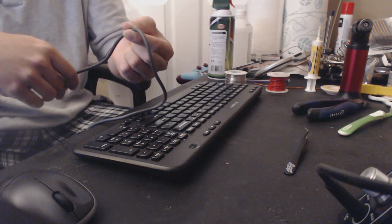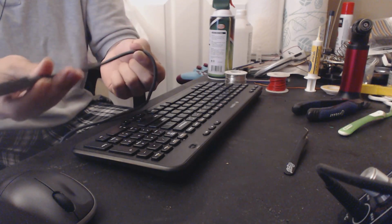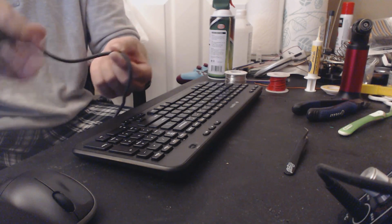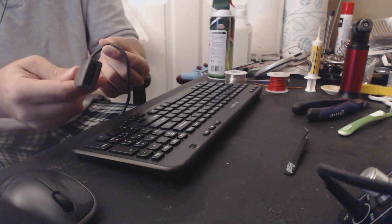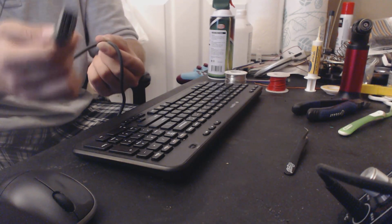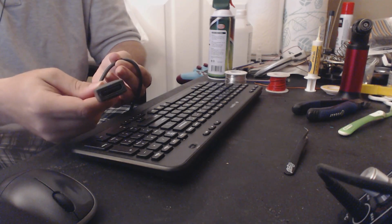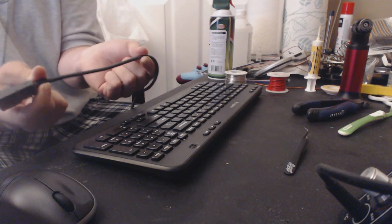The idea of this is that if you want the microcontroller closer to you, you cut on the female end. If you want the microcontroller closer to the console, you cut on the male end. But since usually you're going to be at your computer and not at your console, we're going to use the female end. Make sure you get that right, because that's pretty much the only step you can't redo. I mean, you can always redo it, but you don't want to. So I'd choose the female end, maybe about 3.5 inches, and then you just make a cut.